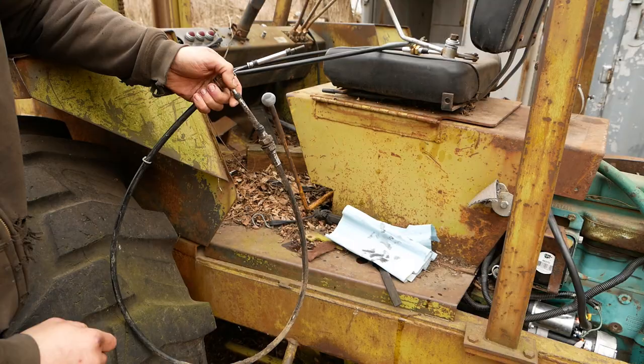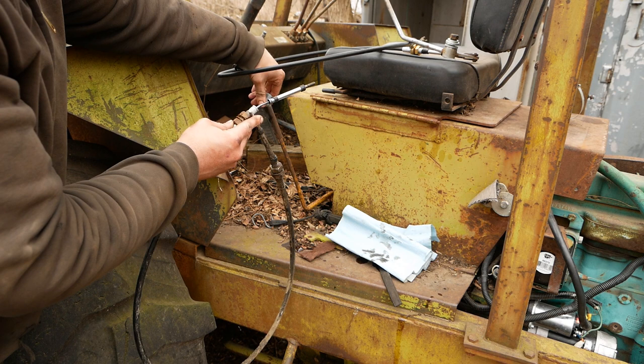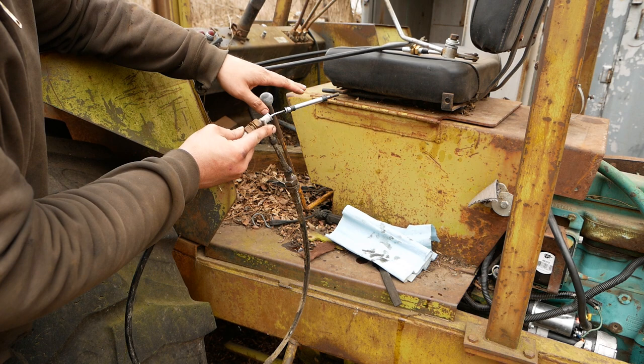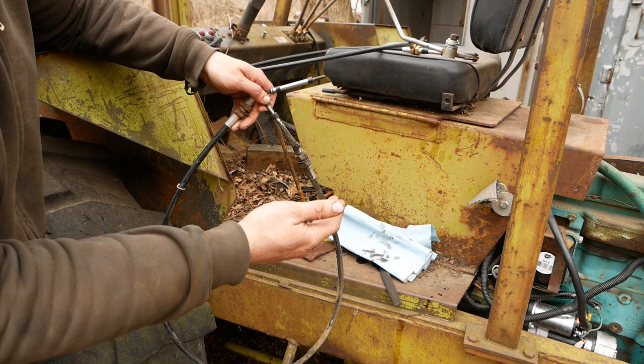This control cable is what shifts the machine from forward to reverse. It's kind of a weird setup on this forklift - you've got a gearbox here, I think it's four gears, and then there's a lever on the console that shifts forward to reverse. But there's no neutral position on the reverse lever like a normal forklift, and there's no torque converter. It uses a clutch with a hydraulic dump valve - it's kind of more like a tractor or backhoe that has a reverser than a normal forklift. Anyway, it works fine, it's just a little unusual.